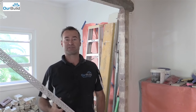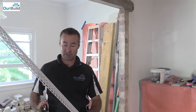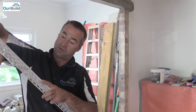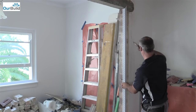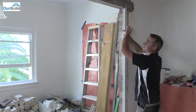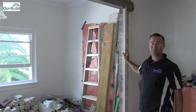Now that our beam's up, bricked up, supported, and propped, the next stage is to start with the rendering. I'm going to put plastic angles around all corners — that'll give us something to render to and give a nice corner. I'll start by cutting these angles with a little 45-degree cut. These angles will just sit in here — one on each side, across the head, and back down to the other side. We'll render these in with a little bit of cement render and then come back to finish it off for a nice, neat finish.